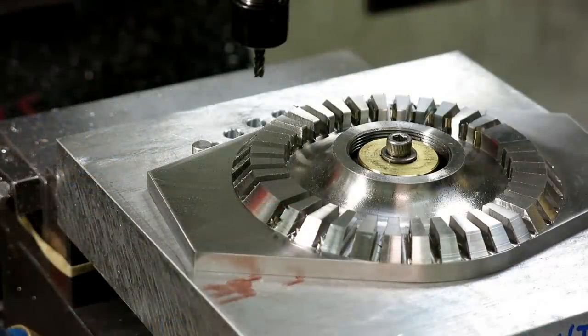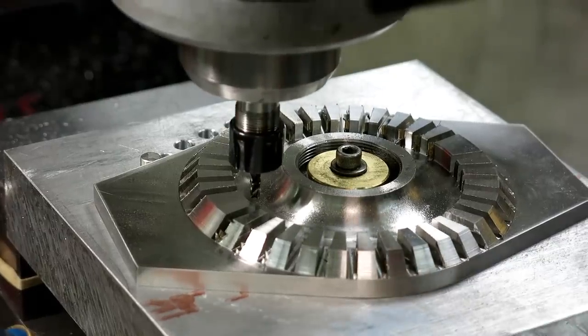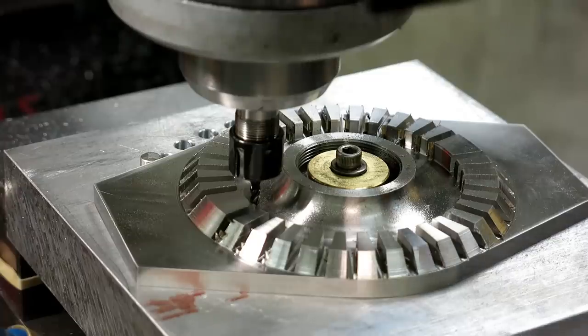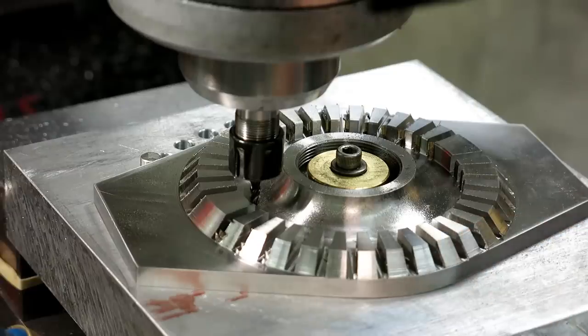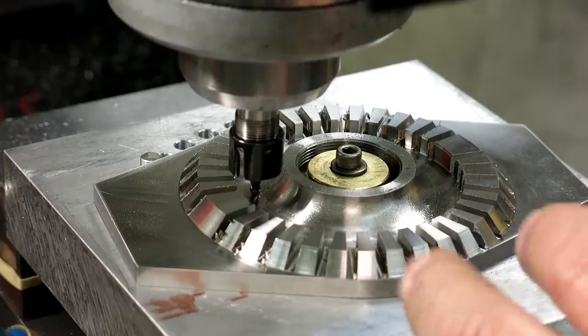Okay, this is the last index on this steel, and I guess I just want to talk about this end mill a little bit. This is a Niagara stabilizer end mill, and this was donated by Niagara Tools, my friend Dennis Nolan, and he sent me some of these. And this is 1/8 inch diameter. It's about 1/4 inch of effective flute length. It's aluminum titanium nitride coated, but it's got a very special variable geometry.